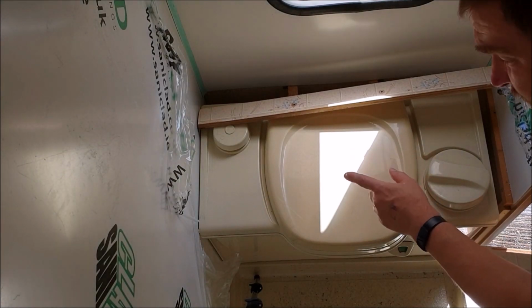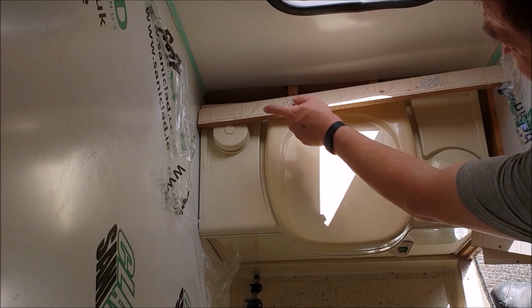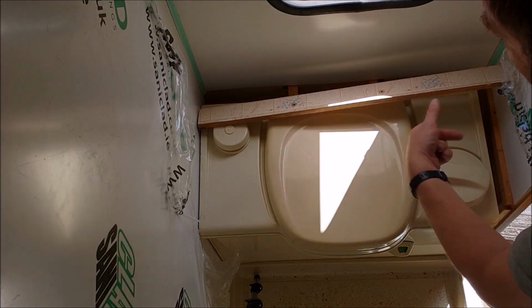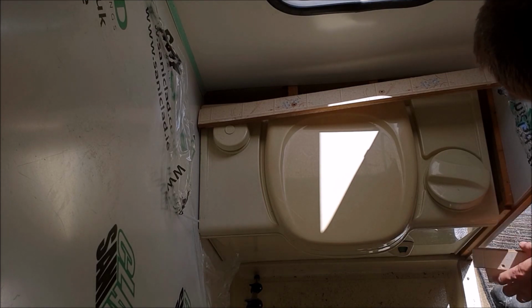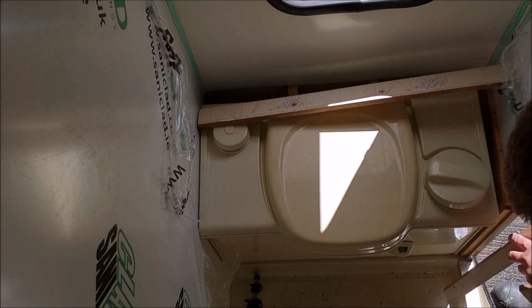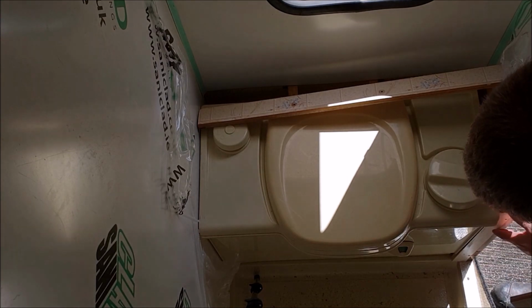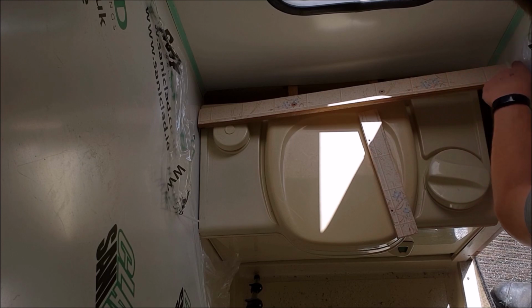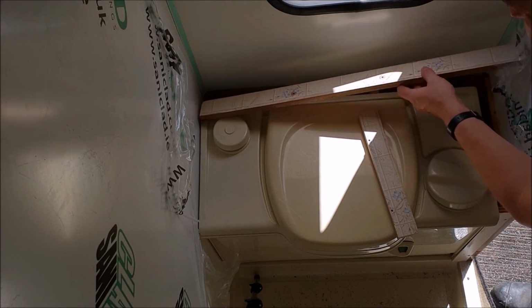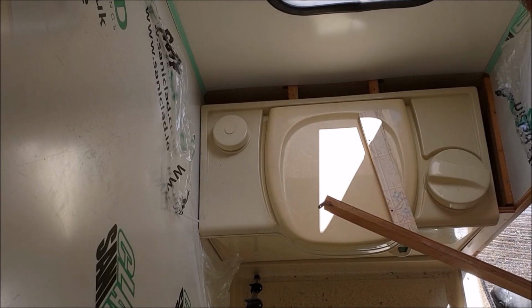Yeah, basically they're all going to need 1.5mm trimming off them. This one in 3 different directions, and these two really just in one direction. This front piece, of course, the dimensions haven't really changed, so that can stay the same, so we'll leave that there. And then this piece will need these corners easing quite a lot more, I think.